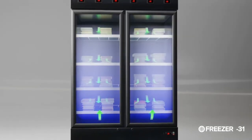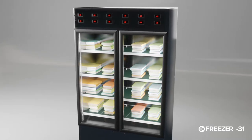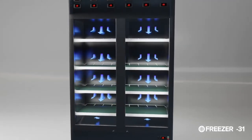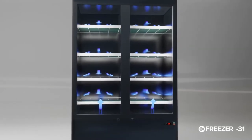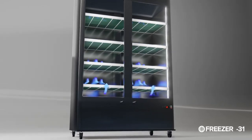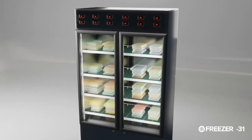Phase 3: Secondary drying. This final phase is secondary drying, during which the freezing materials are dried by raising the temperature higher than in the primary drying phase. The bonds are evaporated between the freezing objects. Freeze-dried materials retain a porous structure. After the freeze-dryer completes its process, most materials can be dried to 1 to 5% residual moisture. Return to the normal temperature.